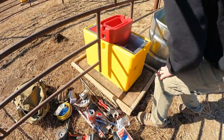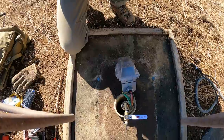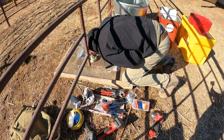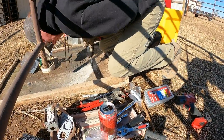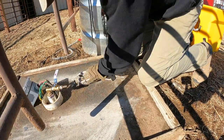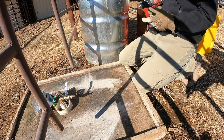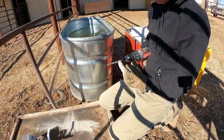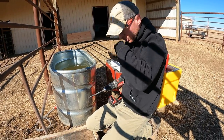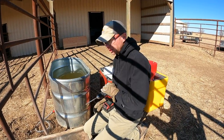Once I get that done, I'll lift this back off. Now it's just a matter of using a masonry bit on the hammer drill and getting these drilled out. According to Ritchie, they want five-inch anchors at a minimum of an inch and a half depth. I'm running them about three inches deep. When I drive them down, I'll put a tape on them and set them to two and a half inches to the top — I figured that out by foaming the bottom for the seal, setting the first one on there and measuring how high it sat off the foundation.